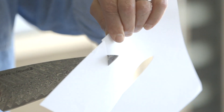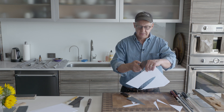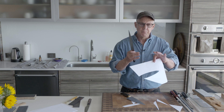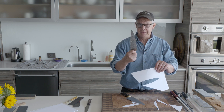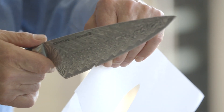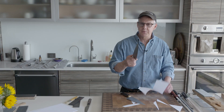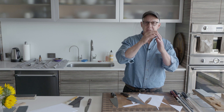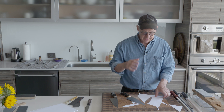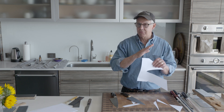So I go to the second part of the test: a slide cut, using the knife more like a saw. You can see how it's reluctant to cut the paper — watch how the paper moves back and forth. That tells you the edge of the knife is jagged and not smooth or polished. Every time the paper jumps, it's encountering a bit of the edge that is either broken out or misaligned. We want to fix that.